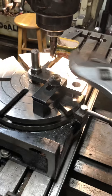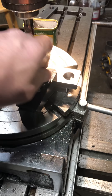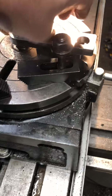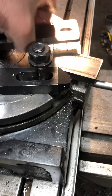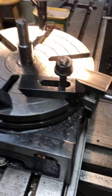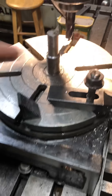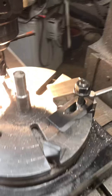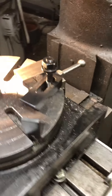I made a little jig. The center of this rotary table has got a Morse taper in it, so I had to put the mandrel in the lathe and cut the Morse taper on it, and then I just tapped it in with a rubber hammer. It's pretty straightforward.